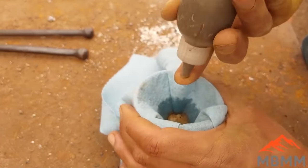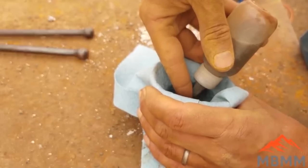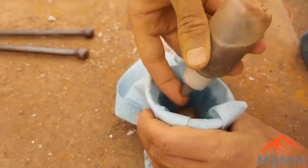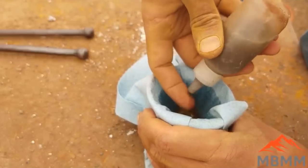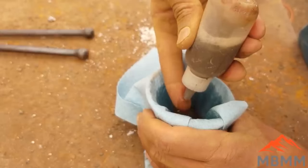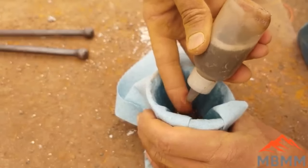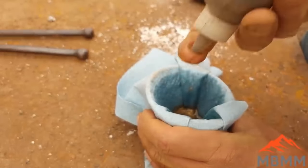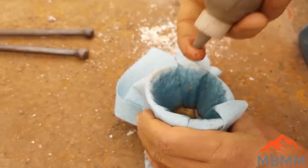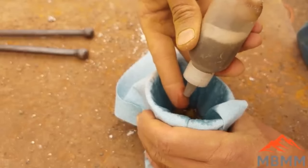I wanted to try and clean up my gold, and I was going to try and cupel it, which is mixing it with lead after you've smelted it and everything. I had a bunch of gold and it was almost clean, and I didn't want to smelt it because that's a little bit of a hassle and an extra step. So I tried just direct cupelling it. I cleaned it up as best I could, got it in this rag, and cupelled it, and ended up with a really nice little gold button. So I've since taken up doing this whenever I'm in a hurry or want a quick result and I don't have time to smelt. I also like to pass this stuff on to you guys.